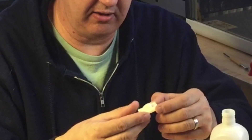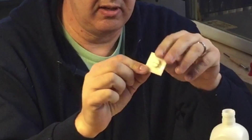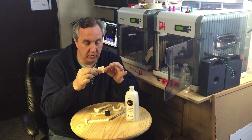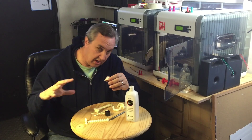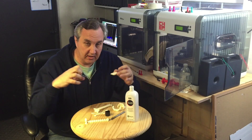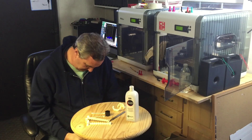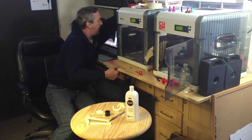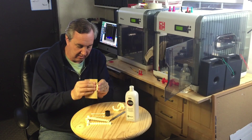So I fused this together and it's got a little bit of a gap here because I split too much of the plastic out when I was carving. But this thing's pretty solid now. Once I put it on the edges, squeezed it together, and spread acetone on top of the edges going across like this, it blends all the plastic. The acetone just melts the plastic, so you can kind of push it where you want and then it hardens, making it stronger. There's probably a little bit of cleanup to do. I've got some sandpaper so I can sand this a little smoother and get rid of the rough edges.